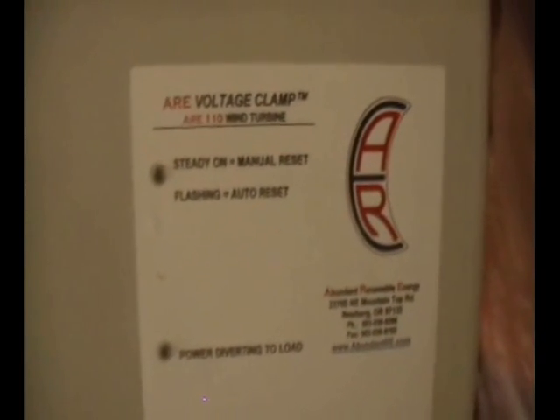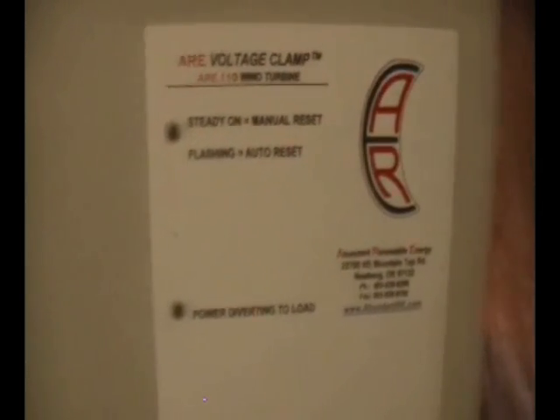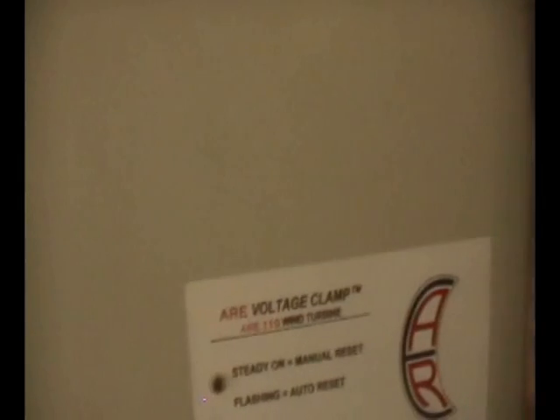So we're back here at the power station and we can talk about the wind turbine now. I bought a 2.5 kW ARE wind turbine — they probably shouldn't call it a 2.5, they should probably call it a 3 kW or 3.5 because of the output it actually puts out. I've been real happy with it. Basically the way the wind turbine works is it generates AC power unsynchronized, and you have to take that AC power and convert it to DC because I have a battery charging system. This is the controller, and the AC circuits from the wind turbine — there are three of them — they come into the bottom of this controller box.